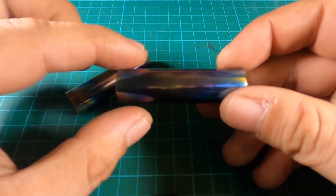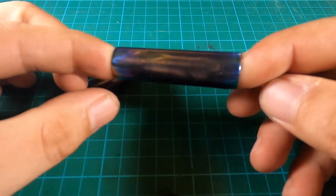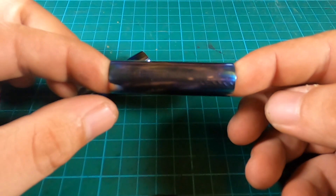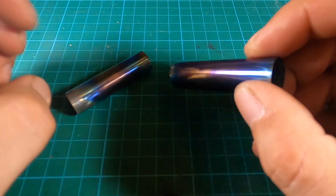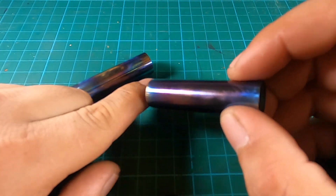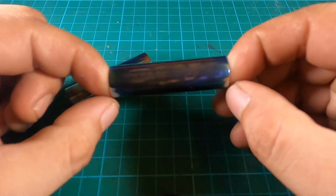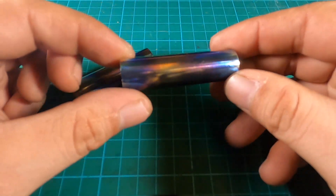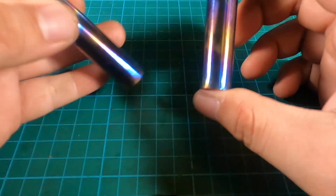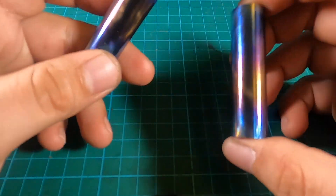What I learned from this — it was actually my third try, I screwed up the first two — is that she liked this one a lot so I'm going to use this on the rod instead. What I found out was that when you burn it you should actually put the tips facing the stove so it burns upward, rather than putting the whole thing on the stove because then you can't really control the heat on the whole thing. So that's how you make your own titanium tubes guys. If you learned something today and enjoyed this video, please like and subscribe. Thanks.